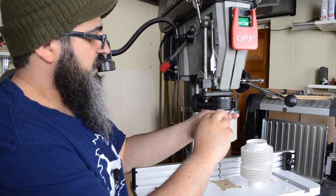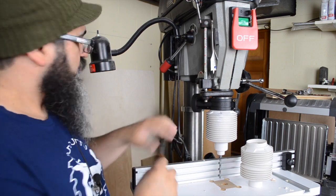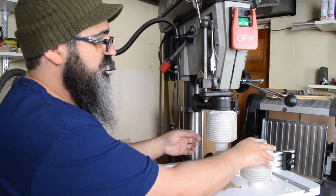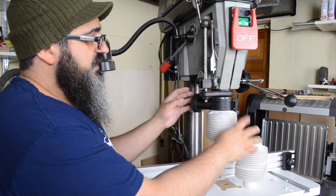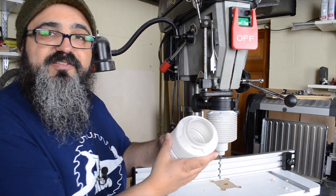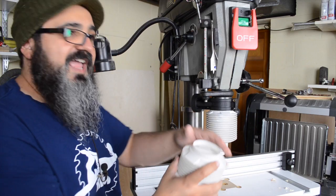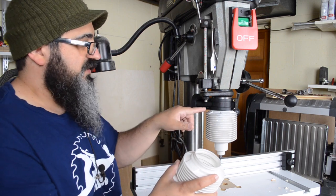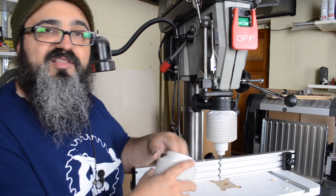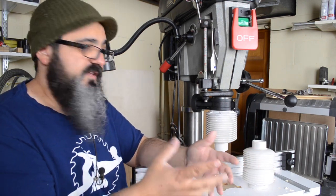Once we have it in position, it's just a matter of coming in with a screwdriver and tightening this so it's nice and snug on the quill — there are four screws. The manufacturer says that once you get the collar in position, you should be able to simply pop the sleeves on and off because there's a little lip that fits into a slot on the inside. I have not had the best of luck doing that. I have to loosen the bottom screws enough so it will release, or more than likely I simply take the whole collar off. But it only takes a few minutes and it gives me the results I'm looking for.